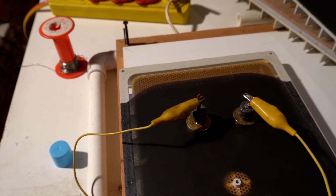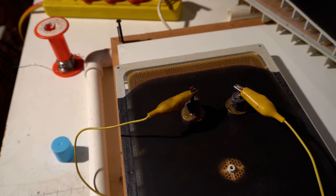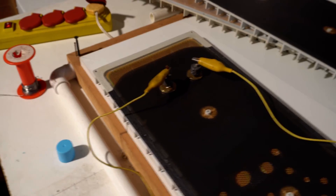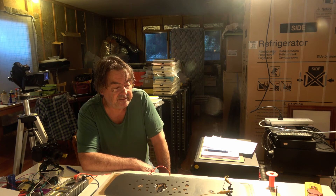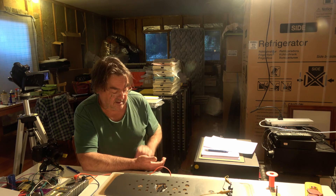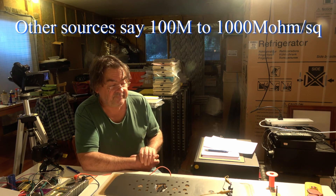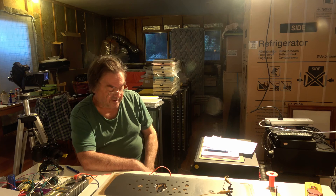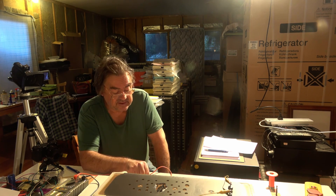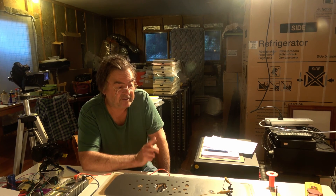However, I've noticed some strange things across my panels. What is the ideal resistivity? From what I've read, it appears that the resistivity set by Mr. Walker and the Acoustical Company seems to be somewhere in the range of 100 to 200 megaohms. That surprised me a bit, because that's never what I was seeing with my measurements. But I have to consider that most of these panels I have are quite old, and maybe they've changed over time.